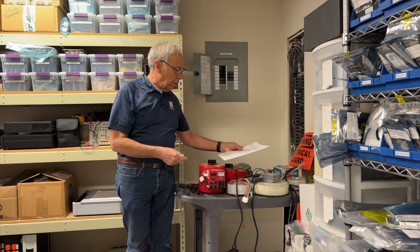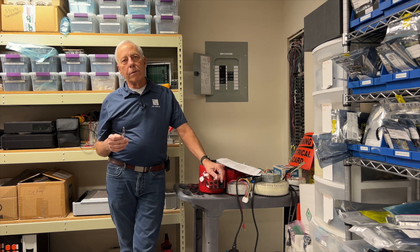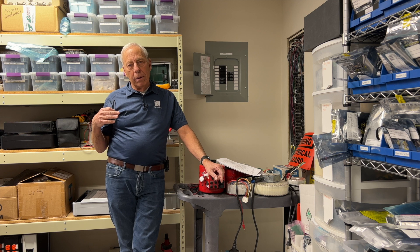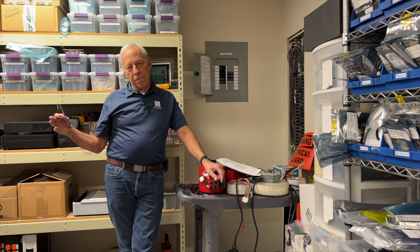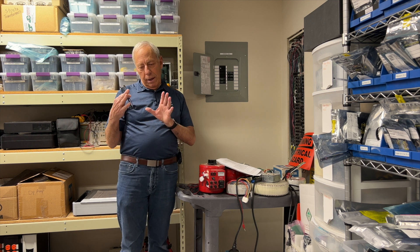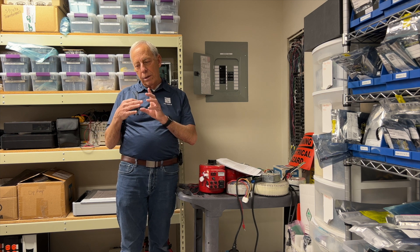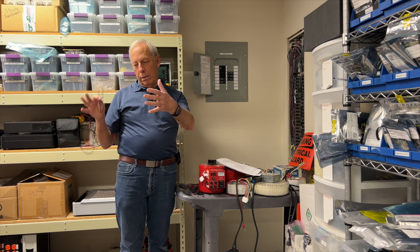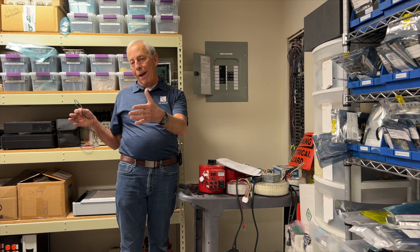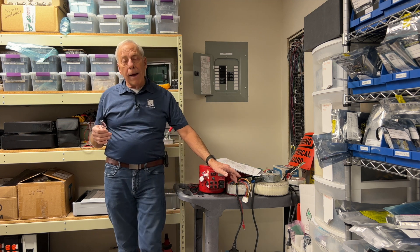Peter, I'm not quite sure I fully understand what you're doing. If what you're asking me is: can I take a balanced cable, run it for 60 feet — 20 meters — and terminate it just before where it's going into this box and then onto a single-ended cable, because you don't have a balanced input on this secondary device — yeah, that's probably okay.